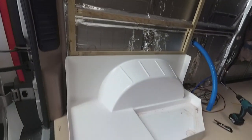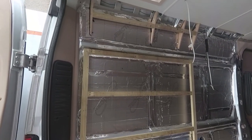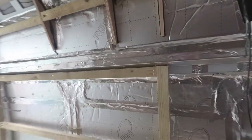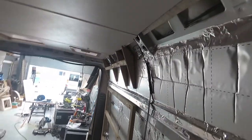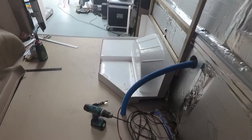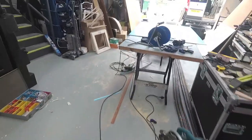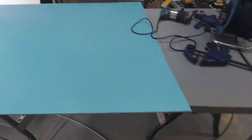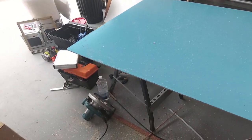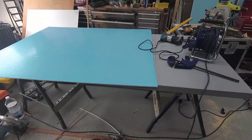All I've done so far is stood the shower tray into place and then built a frame up the wall with some little struts at the top to try and get the wall as straight as possible and in one piece. It's quite nice and straight actually all the way up now. That's going to be 6mm ply which is then going to be clad. I've just scribed the board to the existing roof and routed this round. Now I'm going to fit the board up, get it screwed into place and then stick a flexi panel on the top.